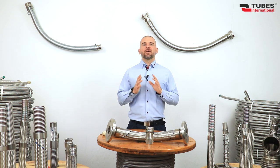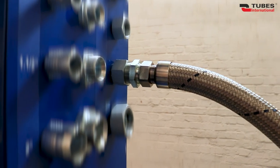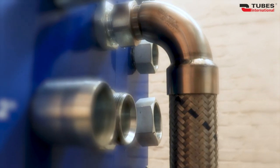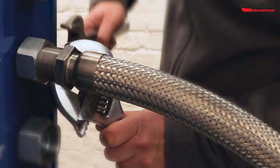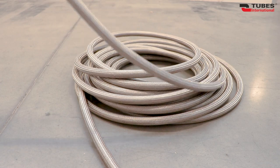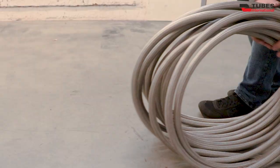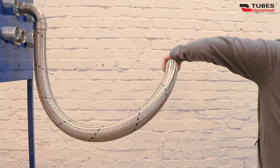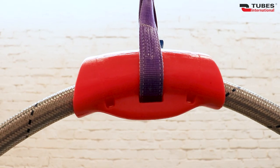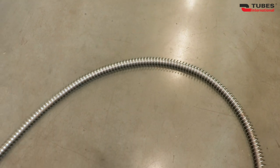Here are some typical mistakes and tips to extend the service life of your hoses. An absolute rule is to avoid twisting the hose around its axis. Use 90-degree elbows if the hose doesn't have support — this relieves stress at the hose end. When tightening, use a control wrench so the hose doesn't twist. Pay attention to how the hose is unrolled or coiled, keeping the coil positioned vertically to prevent twisting, bending, and looping. Avoid three-dimensional installations where the hose is twisted, and if the hose is hung, use a rotating block or support slings to avoid bending or breaking.